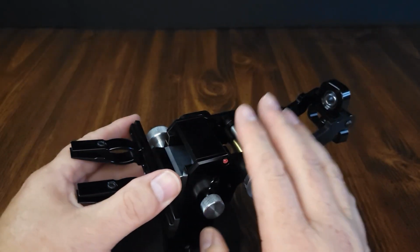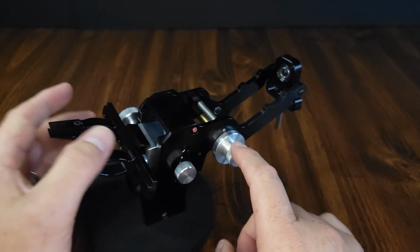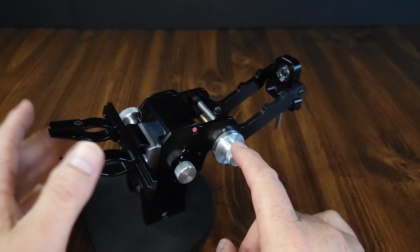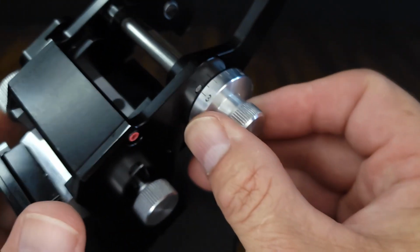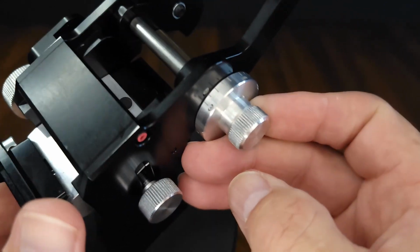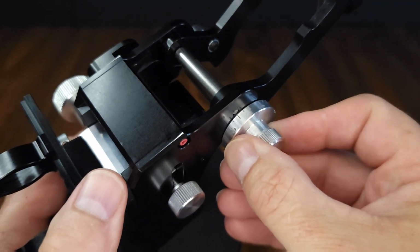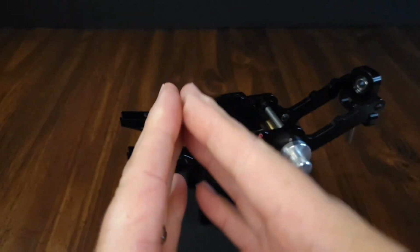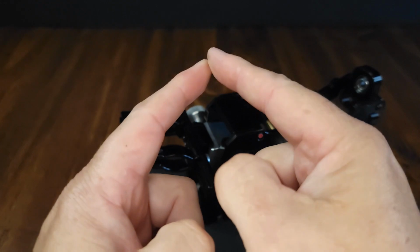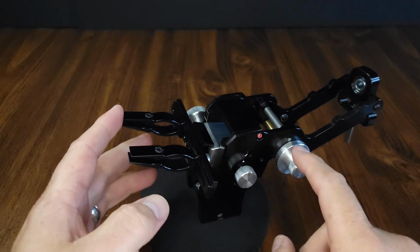And I think this is a good time to mention, this is further into the sharpening process, but while I'm talking about this dial, if you want to put a convex edge on your blade, once you're sharpening, you could start at the 3, get it sharp, move back 0.5 millimeter, go to 3.5, keep the same stone on there. Once you have that completed, go to 4. You could go through these steps, and instead of having a complete apex, you can have a convex edge that's rounded and is going to be tougher. So that's how you do that with the fixed angle system.